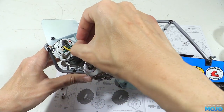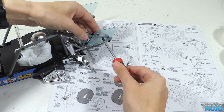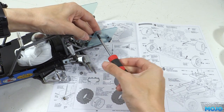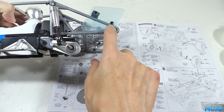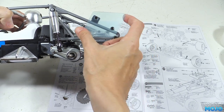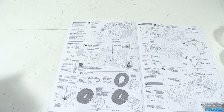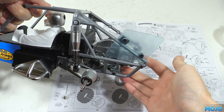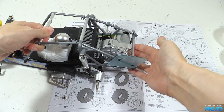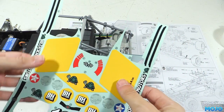It's similar on the other side — another screw and nut to attach the board, but this time we've also got the metal mount that sits up against the cage. I didn't quite get the holes in the right spot, so the board is just slightly off straight. I ended up using a small round file to elongate the top hole into a slot so we can straighten the board, then nip up the screws when it's level. After a little fiddling, we have the motor side trimmed up and the left side board sitting level. Now we just need to take it all apart, remove the protective film, stick on the decals, and put it back together.